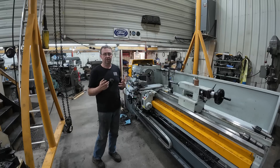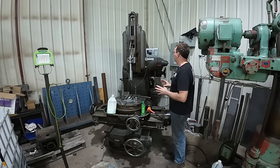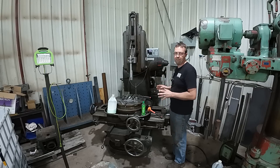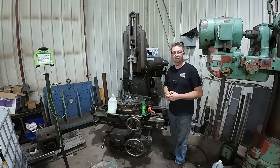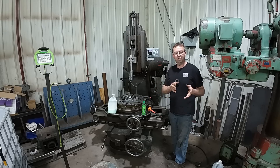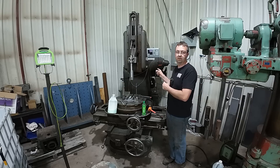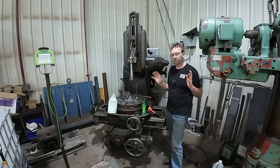We've been doing a lot of upgrades here in the shop. One of those is the digital readout added to the Mori vertical shaper — that has been an amazing upgrade. I just did the first job on it using the digital readout and boy did that help; I didn't have to worry about bumping my indicators. That came about because one of the encoders on the Lucas boring mill finally died after 10 years of in-service use. So I ordered everything to replace that encoder and add a third axis to the boring mill, then took the two-axis readout off the boring mill, moved it over to the slotter, and put the three-axis readout on the boring mill — just a big upgrade altogether.